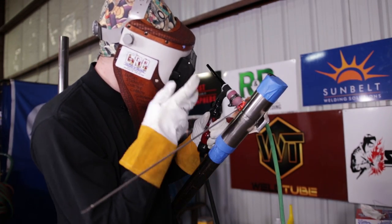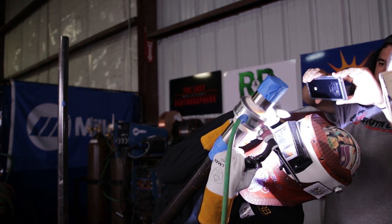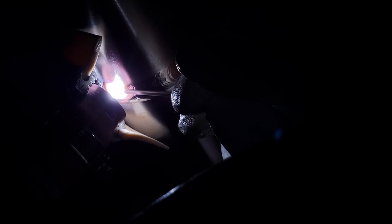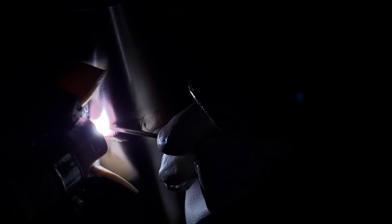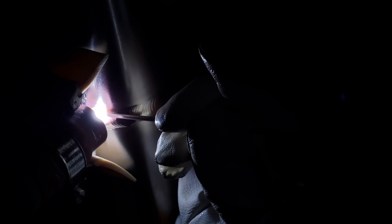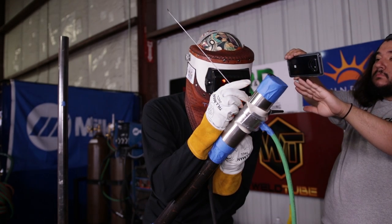I need to figure out what both hands are doing — what my left hand is doing. The TIG torch is nothing more than just a heat source. On titanium, I have the torch on the leading edge rather than the middle of the weld puddle. I open a keyhole. My line of sight is looking at the leading edge of the weld puddle overall, so I can see both the external and internal leading edge. The TIG torch heats the external leading edge, and a split second later the internal leading edge turns to liquid.